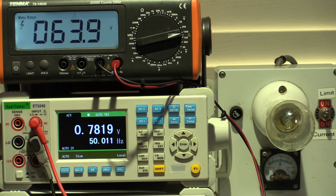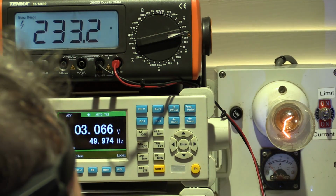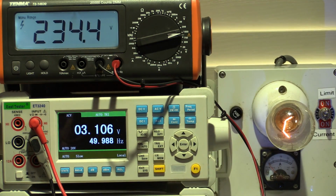Okay, here we go. That's 100 volts AC coming into the transformer. 120. I had some relays clicking then. We've got 3 voltage regulators here on the PCB, I can see. We've got a 7805, which is a +5 regulator, 7812, which is a +12 volt, and a 7912, which is a -12 volt. Might have DC filaments on the preamps, who knows?